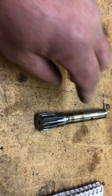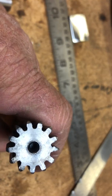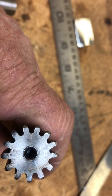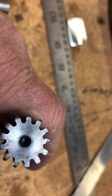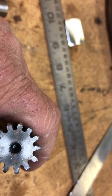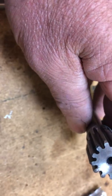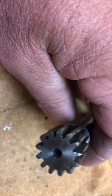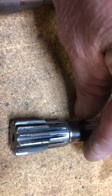And in doing so, I bent a gear tooth, and I've straightened this tooth out some. You can see that tooth right there, top dead center, just to the left of it, how narrow of a gap that is compared with everything else. It was bent quite a bit over to the left, and I've taken a pin punch around it. When this gear is not hard, you can scratch it with a file easily, and I'm trying to bend that back as good as I can.